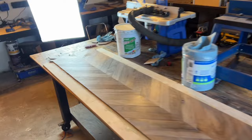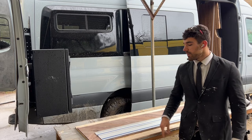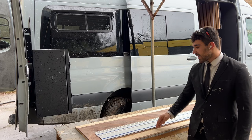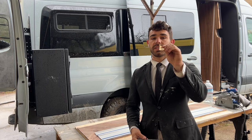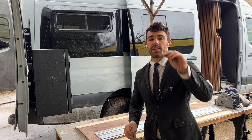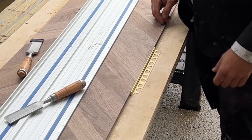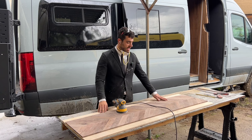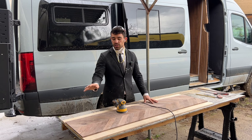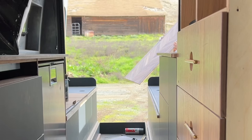That is the center of this floor done — I'll take the circular saw and cut that off when it dries. I was able to cut the ends off the back and have my track saw set up to clean the sides of the chevron. The gold strip profile I thought was a 90-degree angle, but with my protractor I found it is 85 degrees, so I had to angle the track saw at five degrees. This was cut perfectly straight at five degrees and now the profile sits perfectly flush against the chevron. Now I'm sanding the whole floor starting with 80 grit and working up to 220, making sure all pieces sit flush and getting it ready for the floor finish.